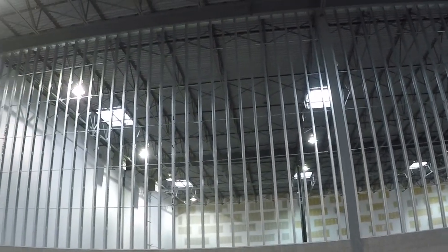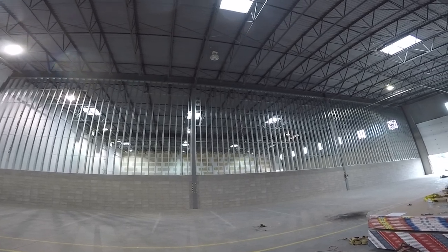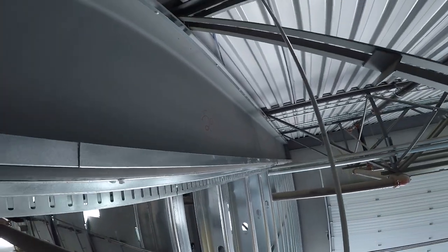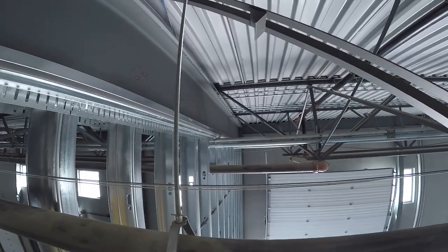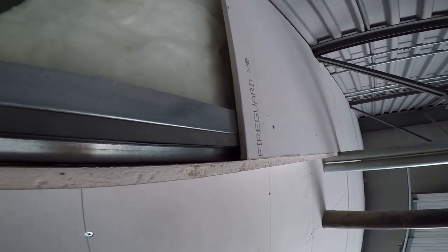Stay tuned — it's not over yet because the bulkhead is coming. Understanding how the bulkhead works is the last part of this wall. I've shot angle at the top and bottom, and there's a hat track at the very bottom. You shoot angle at the top and bottom of the beam to keep the insulation in the beam, because all these beams have to be insulated. Your alternative is to screw it to the Q deck — you can drop an angle and screw a front angle to the bottom of your sheet. Screw hat track on the bottom, and the drywall has to slip in behind the hat track for that deflection — you've got to keep your three-quarter-inch deflection.